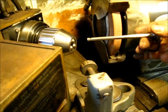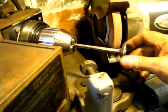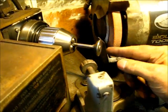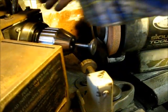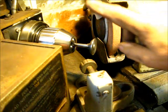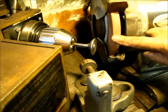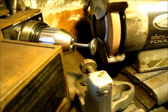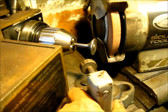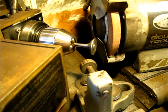I do have it adjusted in the back with a stop that's the correct length for these valves. You push that back until it stops, then let go — it has a quick release. This is in there tight. The wheel has been faced. To face the valve, make sure that everything is correct and locked down. Everything is secure.